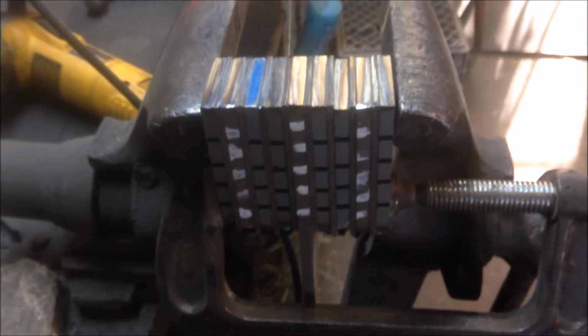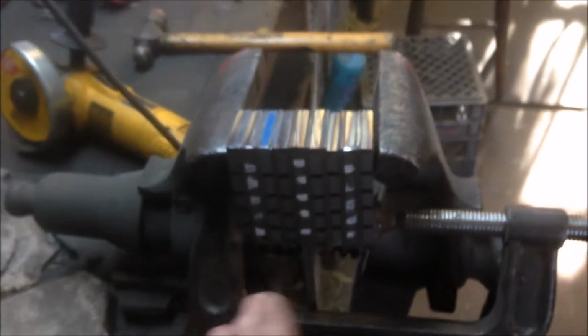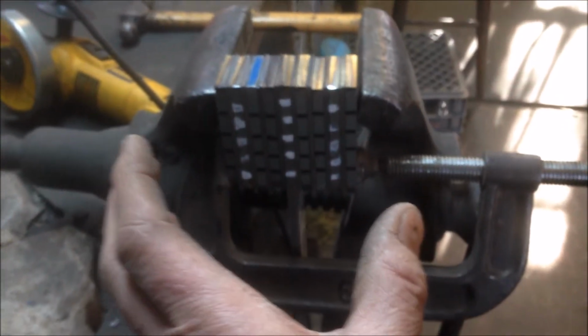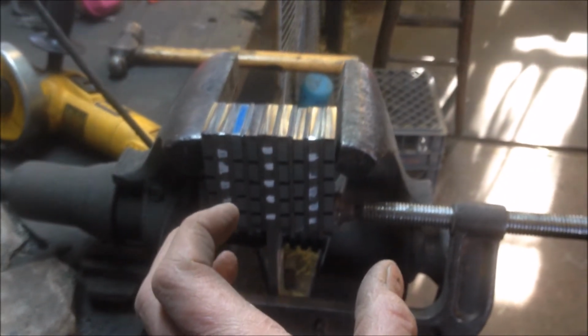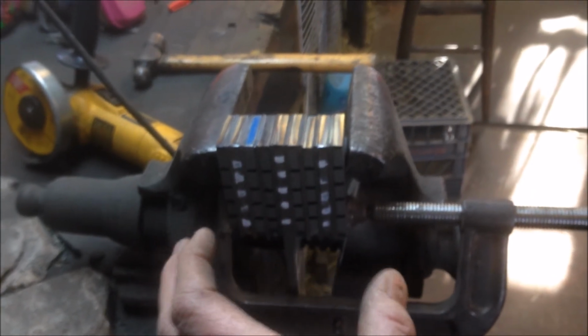It's a coal forge that does the whole forging. When you weld with a welder, like a MIG welder or an arc welder, you're literally just binding these pieces of steel together by their outer edges. When you forge weld, you heat the entire billet up, and it's a form of diffusion weld where the pieces of metal now share common properties. They actually can share carbon molecules or atoms, whatever you call them.